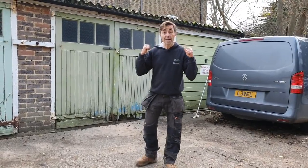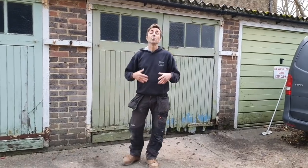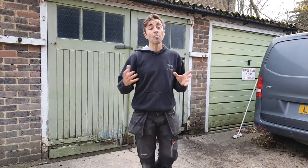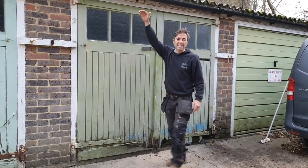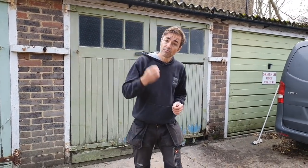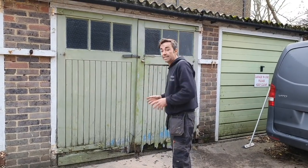We're going to get on, get the old doors out, take these two legs out, replace those as well, and swing the new doors. What we're up against is the garage is nice and plumb here but the head is a little bit out where everything's been moving. We've got to do a little bit of shooting in, so we'll probably use a rail saw for that and an electric planer depending on how much we have to take off, and then we'll get them fitted.